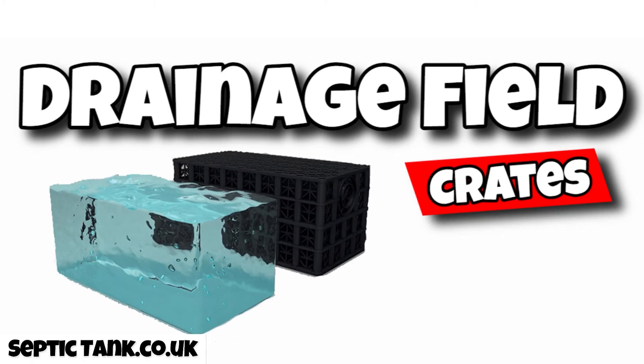If you'd like a really simple and cost effective solution to your septic tank and soak away problems, or maybe you're installing a new septic tank and soak away, then seriously have a good look and do some research about drainage field crates. They're the best soak away in the world because they're easy to install, they're fully building reg compliant, they've got a BS standard, and they start at something like £699 compared to spending two or three thousand pounds on a herringbone soak away.